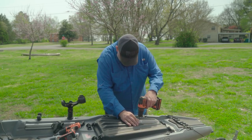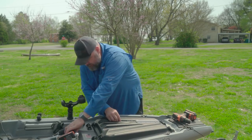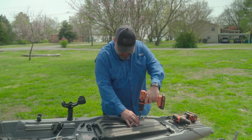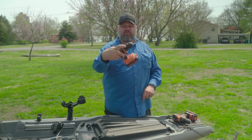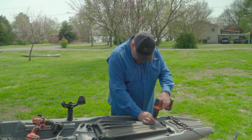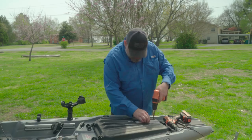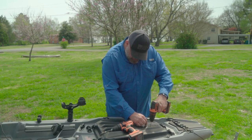Simply center your drill bit, drill another hole in there, kind of ream it out a little bit to get that extra plastic out, and then take your next screw. These are self-tappers, so you're just going to pop it in the hole. You don't want to over-tighten it — just get it to where it first hits. If you keep spinning it, it can just ream the hole out, but by and large you almost can't do that. Set your torque setting on your drill super low — I've got mine on three. Then all you have to do is just one hole at a time, drill a hole, get those shavings out, drop your screw in there. You can see how easy it is and how fast it actually happens.